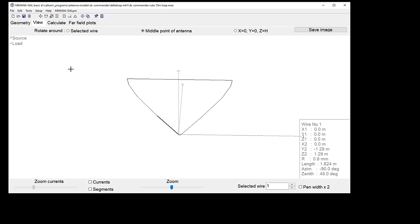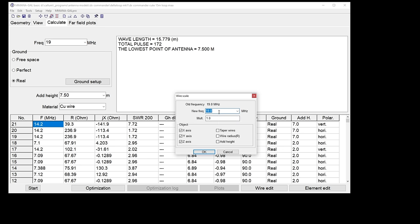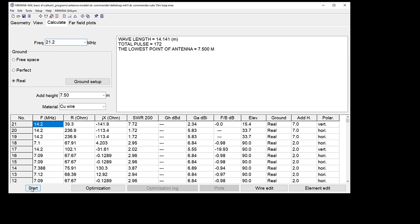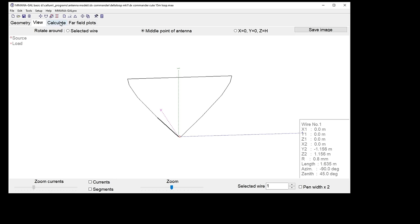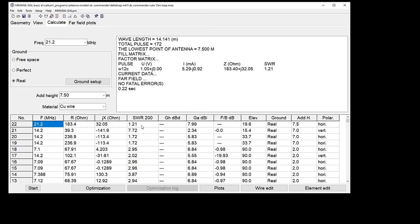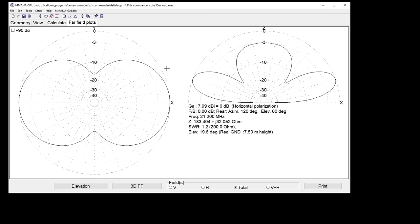I've done some other stuff as well. This is a cute 15-meter antenna using a couple of 7-meter DX Commander poles. It says 19 MHz here — let me move it to 21.2 MHz, the 15-meter band. We've got a bit of height. It's horizontally polarized, fed at the bottom. The SWR is 1.21 based on 200 ohms — so we're using a balun or a quarter-wave matching stub. That's what the plot looks like — more like a dipole quite high up in the air. Six to seven dB better through the middle than a straight vertical, but you're up at 7.5 meters, taller than a scaffold pole.